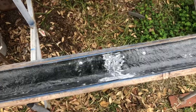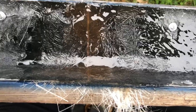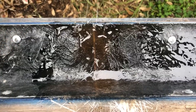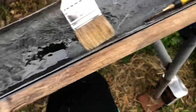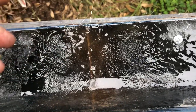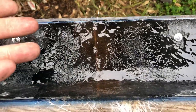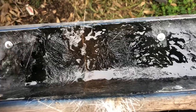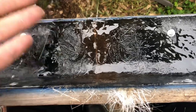That should be more than enough. I'm going to do it on the back first and then on the front after this has all dried up. This is about two layers of mat, which is more than enough because this is technically only adding to what I already have. I scuffed it down with the angle grinder. The key component is we have to grind down the old material and lay new material on it. Once this has dried up completely, I'm going to take off the screws, flip it over, grind the other side, lay fiberglass on top, sand it smooth, apply the Bondo, and it should be done.